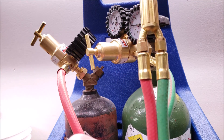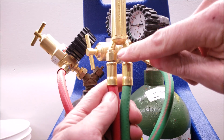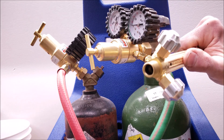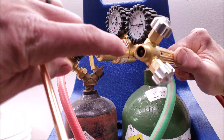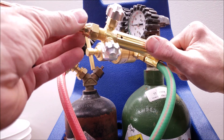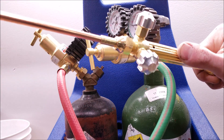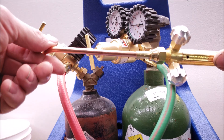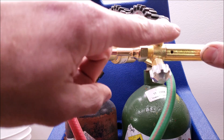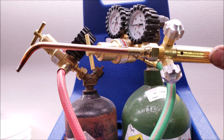In reference to the handle assembly with the hoses: it says 'oxygen,' that's why you have your green hose attached, and it says 'fuel,' so you have your red hose attached. There's a rubber grommet on the inside and a rubber O-ring on the inside here. As this tightens on clockwise, it has that extra seal. I usually have it faced like this so that when I'm adjusting the handles I can see my flame very well. I'll go ahead and tighten this up with my six-inch adjustable wrench.